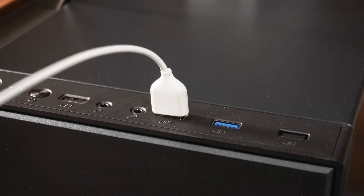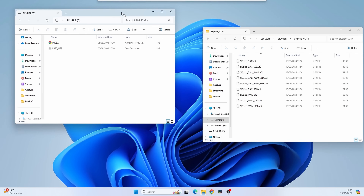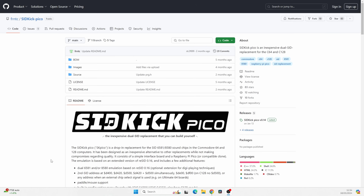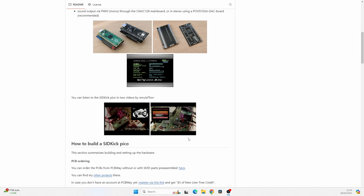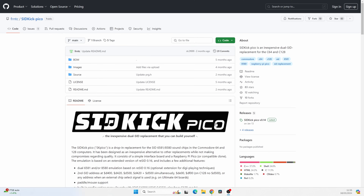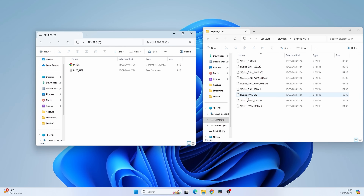With that in mind I need to program the Pico to do just that. Using a suitable USB cable I attach it to a nearby PC and press the button on the Pico. An explorer window will pop up showing the contents of the Pico flash memory. Programming it is as simple as dragging and dropping the appropriate file onto this window. It took me a few minutes to find the zip file containing the firmware — there isn't a direct link on the main page. I scratched my head for a while and then noticed the releases section on the right. The file I want is the standard PWM version without fancy LED or RGB stuff. Dropping that file onto the Pico window makes it disappear, and that's it programmed.